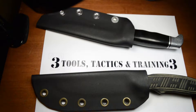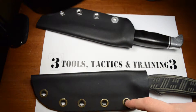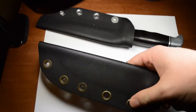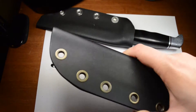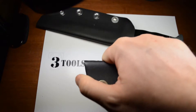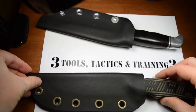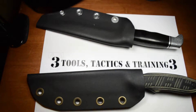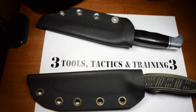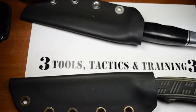Once I pressed it and shaped it around the knife, I cut it the rest of the way, drilled holes for the rivets, hand-pressed the rivets in, and sanded the edges with sandpaper on a sponge until smooth. That's a general idea of how you make a kydex sheath at home. If there's enough interest, I could make an instructional DIY tutorial — let me know in the comments if that's something you want.